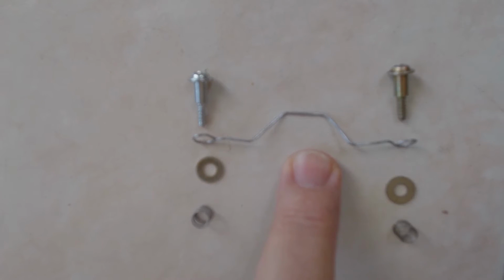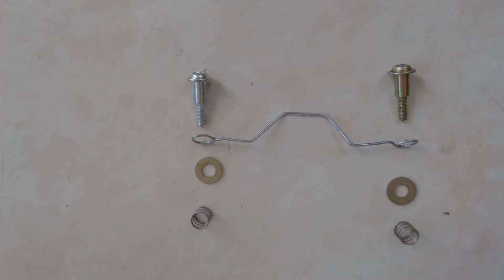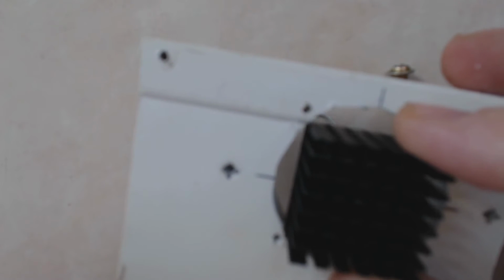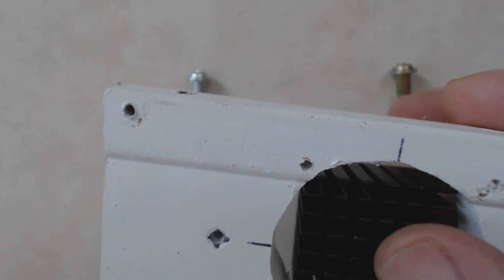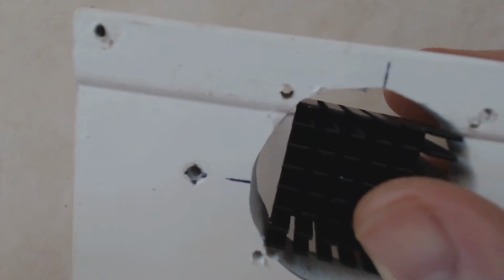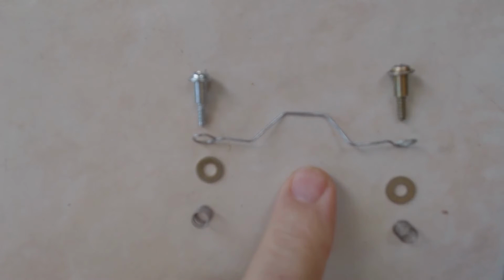This bracket goes into the heatsink and holds the heatsink against the processor. This hole is designed and cut so that the heatsink will just fit through, and the way I've designed it is it's held slightly encased in the lower portion of the bracket so it can't go left or right. The up or down is taken care of by the bracket in this case. And I'll go ahead and mount that and let you take a look and see what that looks like.